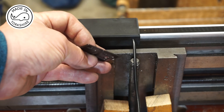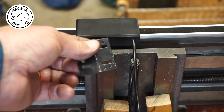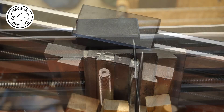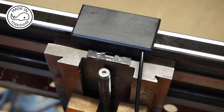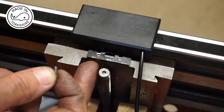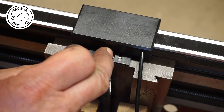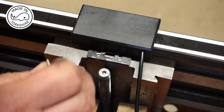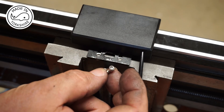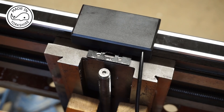That's worked out pretty flat. I'll just undo the ends, fit it to the back and then see how it fits on this face here. This must be my lucky day — I've never known things go so well and smoothly. The bracket's on and I've put a couple of washers just under the bracket on this face; they're not tight but they're not loose, so hopefully they're a perfect fit. I'm going to drill and tap an M3 thread in these two locations and put these little M3 cap head screws in place. Hopefully that'll be the X axis done.